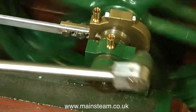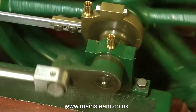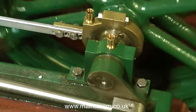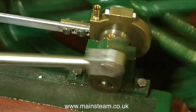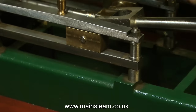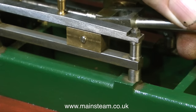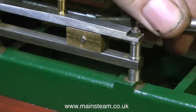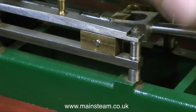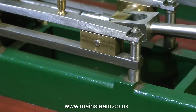The main bearings are slightly unorthodox — they do not use split bearings. Coincidentally, on the last Twin Victoria I worked on, the arrangement was exactly the same. Split bearings are used for taking up wear, but luckily in this case the bearings are not worn. You can clearly see how much movement there is in the crosshead — quite a ridiculous amount — not to mention how much movement is in the big end itself. Everything is a very sloppy fit and something looks very suspicious. These components will all be removed and repaired where necessary, and I'm also going to take the cylinder off and remove the cover to have a look at the piston arrangement.